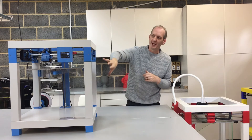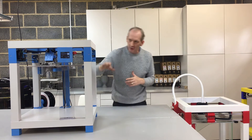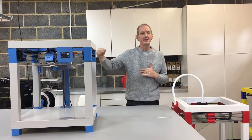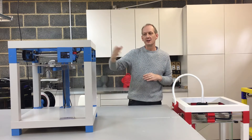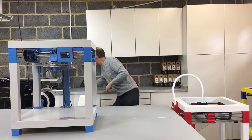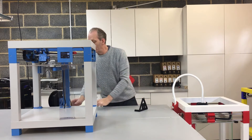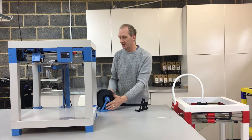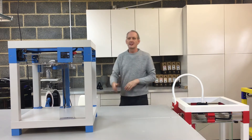I'm going to do close-up videos on this as well, but you will see it's going to do the bed leveling now as it starts a print. The heated bed has gone up to temperature — I've set it at 80 degrees — and the hotend is set at 210 degrees. It's about to start printing one of the holders for the desktop version, which has the short legs so it's ideal to sit on top of a table. It's done the auto tramming and is now just doing a prime line before it starts the print.